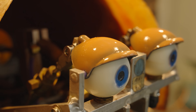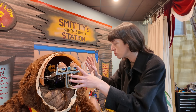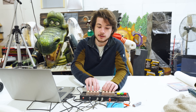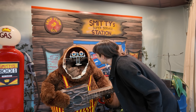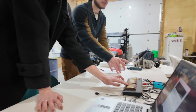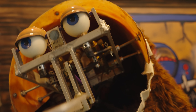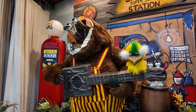Wow, that's so cool! I can't help but notice there's a ton of extra pistons, joints, and movable parts around the eyes especially. Could you speak more to why that area requires so much more detail? With the eyes, you're enabled to do so many different expressive things. I can make him look surprised, I can make him look suspicious — the eyes are really important. Can I try actually moving him around? Yeah, absolutely. This is the control board — the latent programming system. It allows us to program all the new songs and movements for the characters. Each button corresponds with a different movement: mouth, eyelids, eyes, and different head movements. That's how you get all these compound movements where things are moving together.